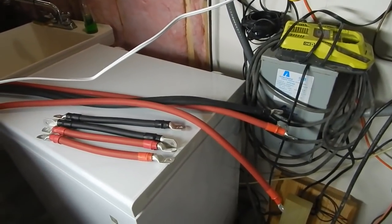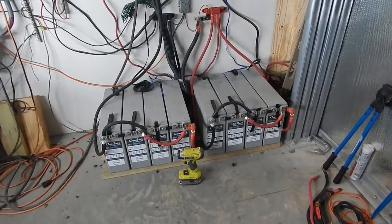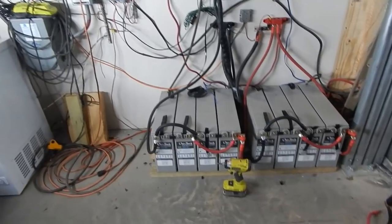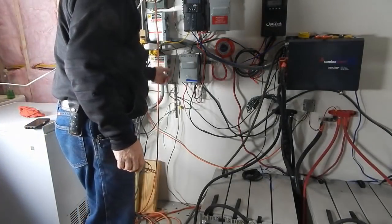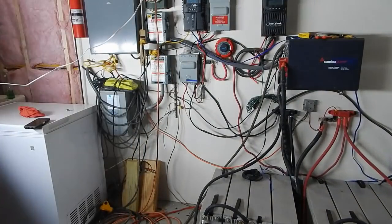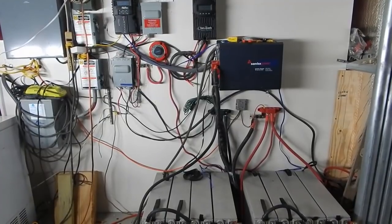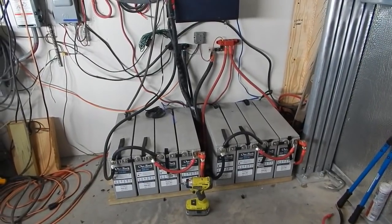I've got the cables made. Now I'm going to swap them out — there's no sense watching me change cables out. Four hours later, I've got all the new cabling installed. I just looked at the Midnight controller and it's telling me I've got 24.5 volts. So now I'm going to see if the transfer trips this — that's normally when it happens. It did not. So that's cool. It takes one hell of a surge when that turns on. So that's it — I'm updated. It's about 10 after 4, I'm freezing. I've got a whole bunch more wires to tidy up, but I'm going to try to get more solar installed. I've got to hook up the Outback to the new solar panels and I have another charge controller going on the wall, so I'm going to end up tearing that all apart again anyway. I've got the new 4-0 cables installed and it should work much better — that was long overdue.